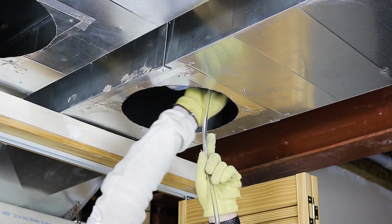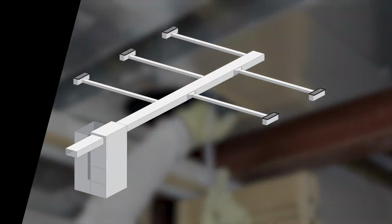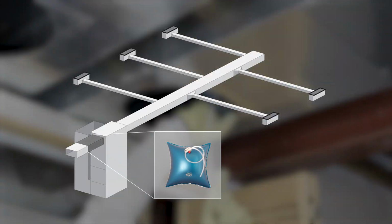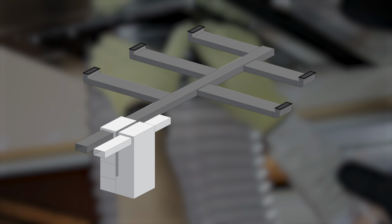Once the zone bag is in place, compressed air can be used to fill the bag and block off the duct. In this example, if a supply system has 2 main ducts coming off of it, a zone bag is inserted here while the other side is cleaned. Once this section is cleaned, the zone bag is removed and inflated here. The other side can now be cleaned using the full force of the power vac. This same principle can be used if more than 2 mains come off the plenum.